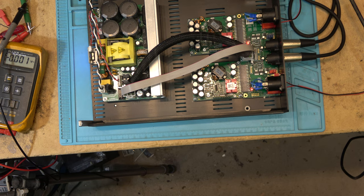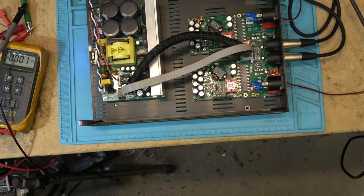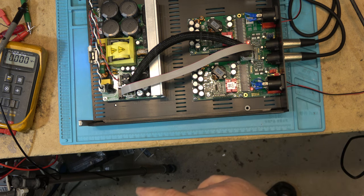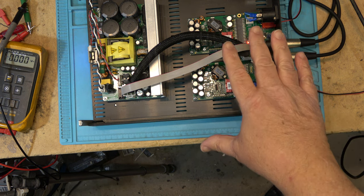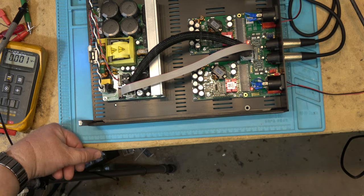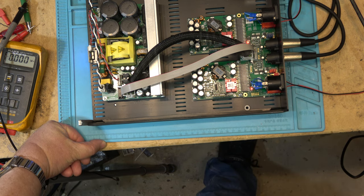They have no reserve, and you hit that maximum power, and they clip. And when they clip, the harmonics that they create just cook your tweeters. And that's why you need the power of these units, because when you have this kind of power in reserve, you're never going to clip. You're never going to blow your speakers. You're never going to drive these things to full power, but it's sure nice to have that headroom available. And that's the first thing I noticed with my Crest. And the guy that owns this also owns the two big BGWs that I've worked on.